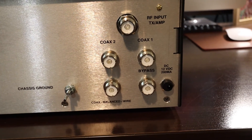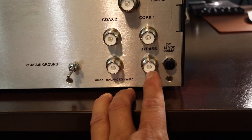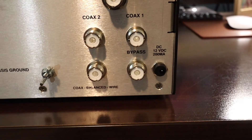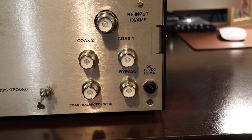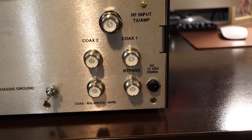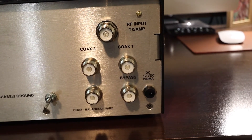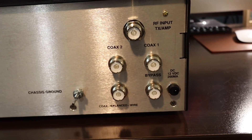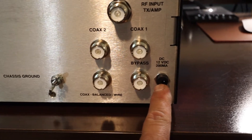You can connect two different types of antenna. If you have an antenna that doesn't need a tuner, you have a bypass option there. The coaxial connector for output to a dummy load also bypasses the tuner. They also say that the meter circuits are active if you have the AC adapter connected to the rear panel — and that's the 12-volt DC input.